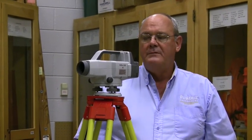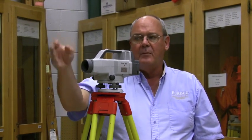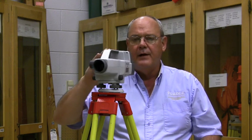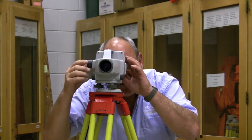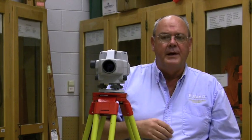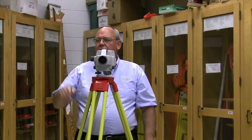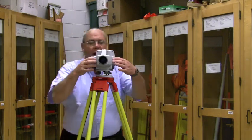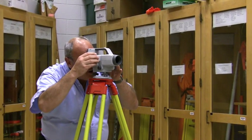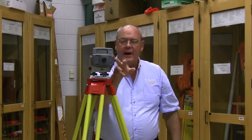Using this instrument, let's assume we're out working and the battery goes dead. If the barcode rod had an English rod on the opposite side instead of metric, we just turn the rod around if we're working in English units. If working in metric units, you simply turn the rod around and the instrument guy looks through, focuses the crosshair and objective, and the rodman holds the rod plumb and simply reads it. Or if you have an English rod with you, you pull it out and read it exactly as you would with the auto level. This instrument can be used with or without a battery, but with a battery we have several functions.